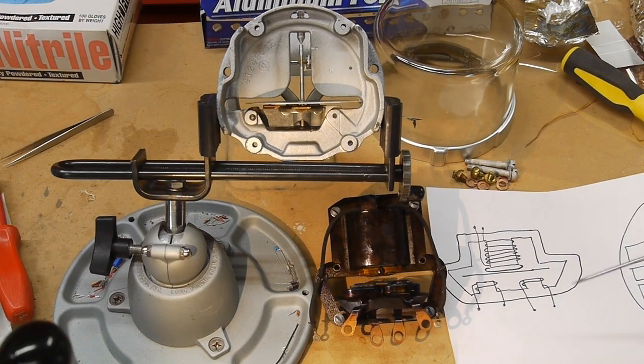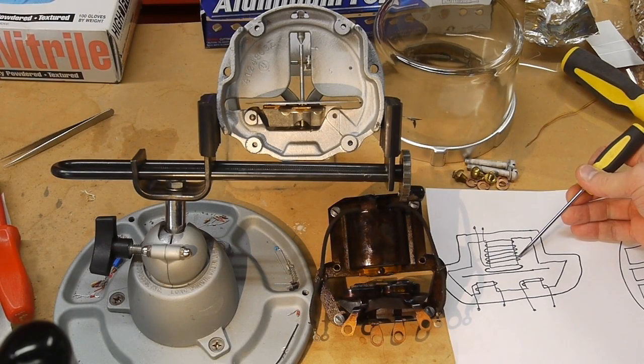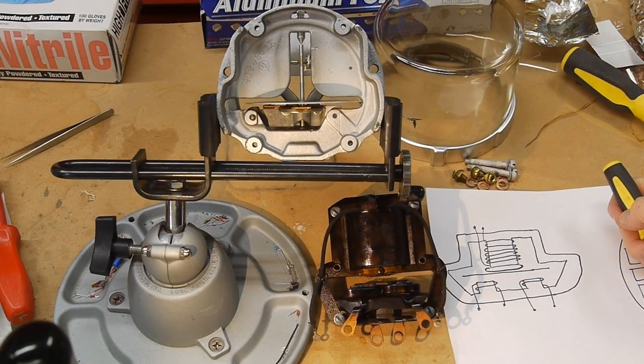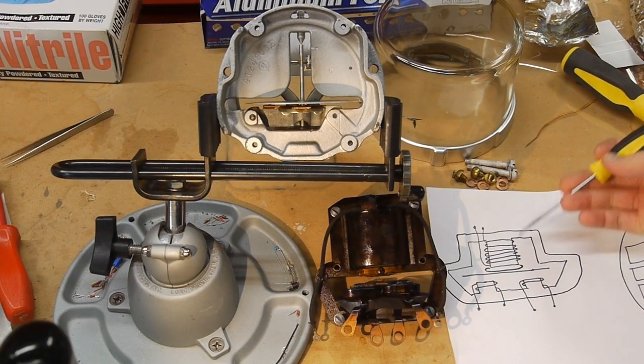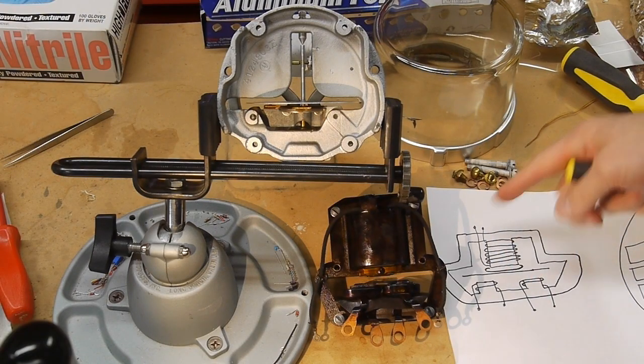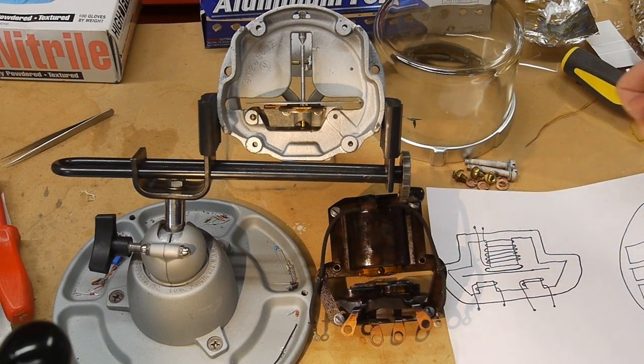You might wonder why this copper ring introduces a 90-degree phase change - why not 180 or 42 or any other number? The answer is that when the current flowing through this coil is at its maximum rate of change, then the magnetic field will be at its maximum value. That's a law of nature - it's basically why sines and cosines are 90 degrees out of phase and all kinds of other good stuff. So basically what we've done with this 90-degree phase shift is create a moving magnetic field, just like the legs of a centipede, that pulls the disk around.